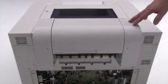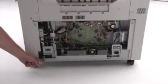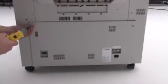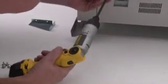Now that the top eject unit is installed, we have to install the remainder of the sorter. The top eject unit by itself will not operate. I've already started the two lower screws for the back cover — I'm going to place the cover on those screws, pivot it into place, and secure the top ones. To install the 10-bin sorter to the SureLab unit, there are six pan head screws included in the accessory kit. Two of those go on the rear bracket underneath here — I'll put one in loosely first.